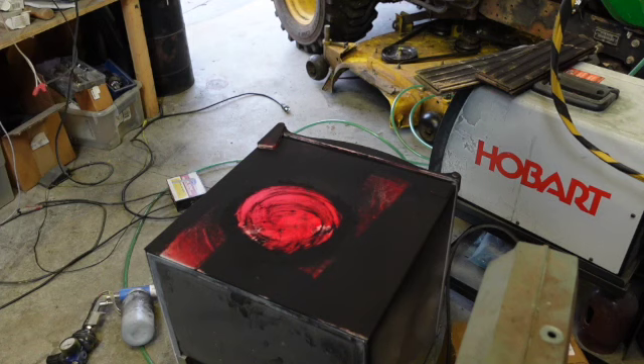It just doesn't work as well, but I'm only going for sort of an opaque kind of thing here - I'm not going for a full coating. This is going to be inside and it's glass already, so that's cool. As you can tell by the powder residue, it takes a lot of powder and it just barely works. But the trick here is: get a little coating on it, get it sticky, get it hot again, and the second layer will coat a little better. That's the whole trick to this.